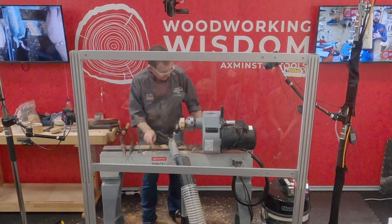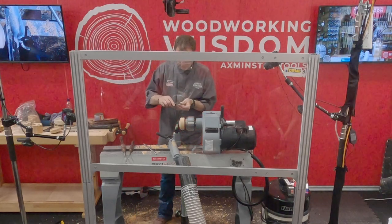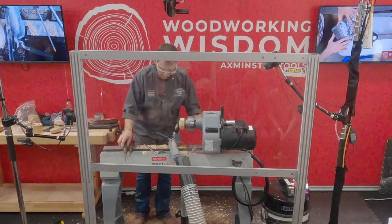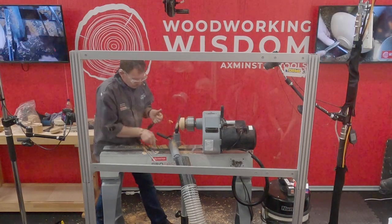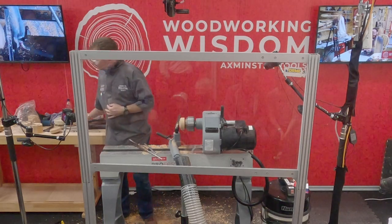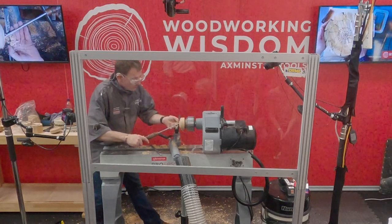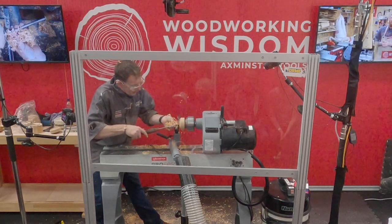Next thing I'm going to do is hollow the inside. We've got to find the middle — using a small oval skew. This will need to be about half our depth, including what is in the chuck. We're going to drill a hole with a small spindle gouge. The flute is right on side at nine and a half to ten o'clock, into the hole and back up. Quick and fast — this is about bulk removal.